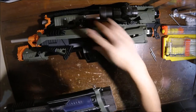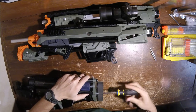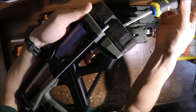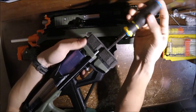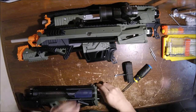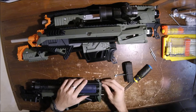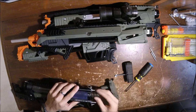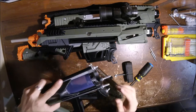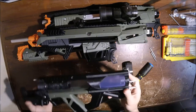First thing you do is take out the butt plate — unscrew the butt plate screw while keeping a hold on the nut on the back. You can unscrew it and it just pops right out. Then you have to undo the acorn nut, locking nut, or regular nut depending on the version you have. Then you have to take off the butt plate and you have access to the spring. But if you want access to the ram rod, the plunger, or everything else on a regular non-takedown Caliburn, you have to go through and take out the rest of the nuts — there are four nuts to take out.